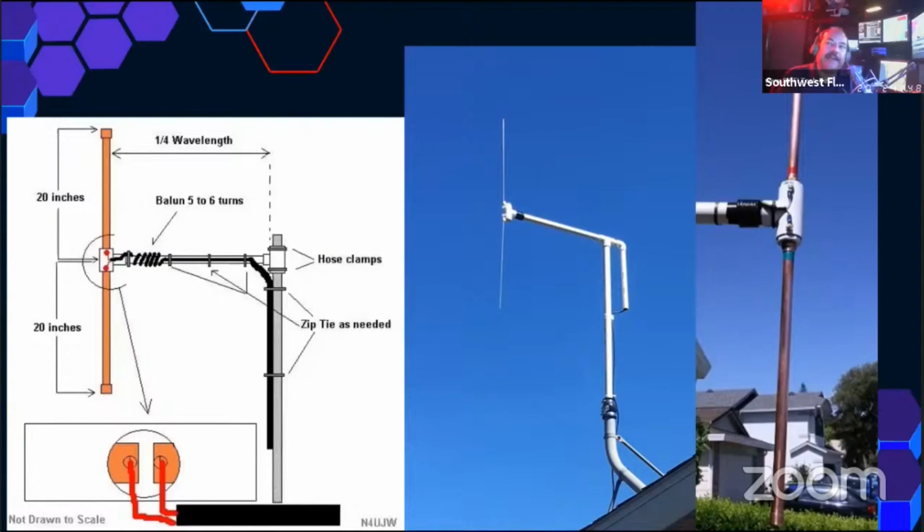You can build that antenna, the one on the right there. You've got your pigtail, and you've literally got about $20 worth of parts there, and that's a great little dipole. The one there in the middle, the spines on that, the radiating elements on that can be anything. They can be a coat hanger.